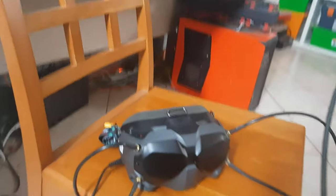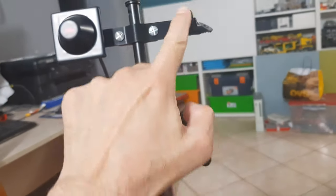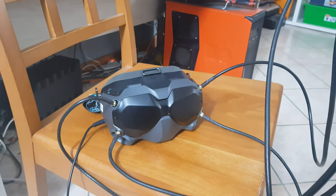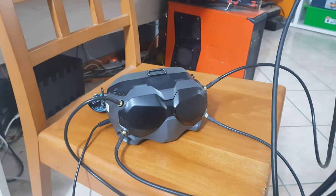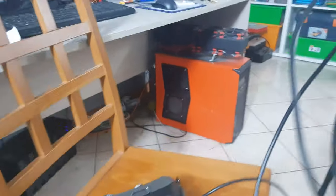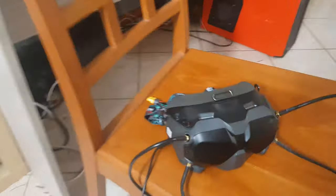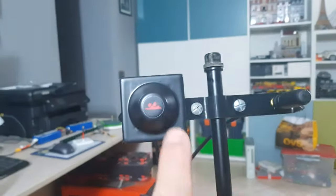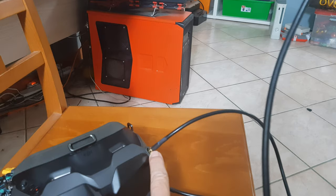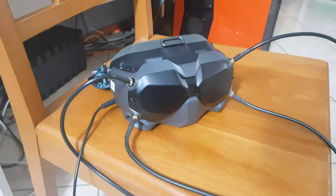In the first test I'm going to have the three stock antennas connected to the goggles via an extension cable, but the stock antennas won't have influence because my drone is on the other side of the house — lots of walls, rooms and concrete — and the only antenna that will have an effect is this highly directional Sniper 2 antenna. So first I will put the Sniper 2 antenna directly connected on the top left connector in the goggles, pointed in a precise direction towards the drone, and see what happens.